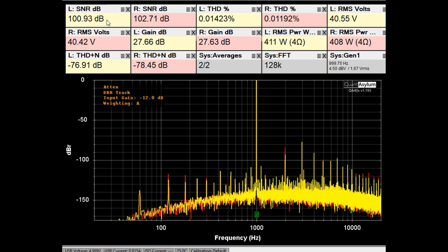I should also point out that at this power level the Aragon is drawing about 11.3 amps AC. THD plus noise is better than −77 dB. This amplifier is meeting its specification requirements for the most part, other than the SNR being a little lacking — 101 dB versus 110 dB with A-weighting. I'm not going to cry any tears over that.